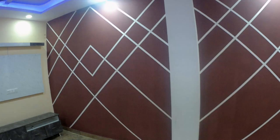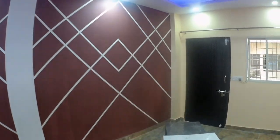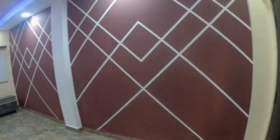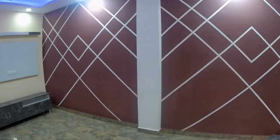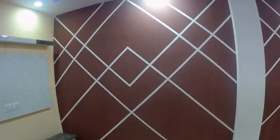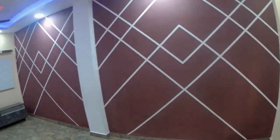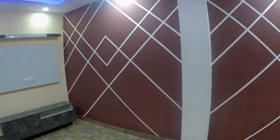Moving forward, after applying the dark paint you have to use a roller brush. You cannot use a normal brush — you have to use a roller. I will also provide a link of the roller in the description; that roller is the best for painting geometric designs like this. If you don't know how to use the roller, practice in a spare space first, so when you know how to use it you can go for the actual painting on the actual wall.